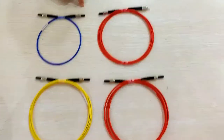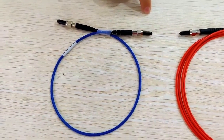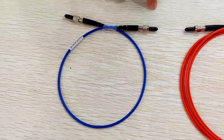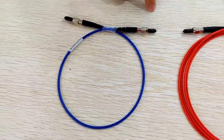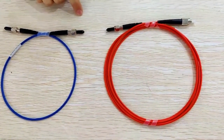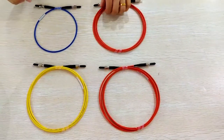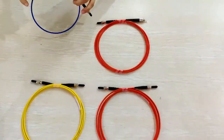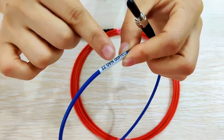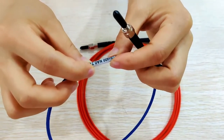The cable uses pure silica fiber and the numerical aperture is 0.22. The wavelength range can be 400nm to 2200nm. We can see the label 'SRIH 400' which indicates the working wavelength band.